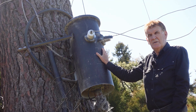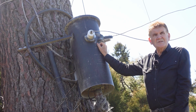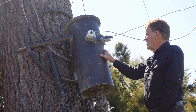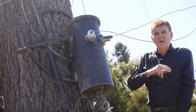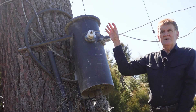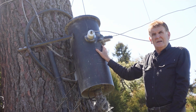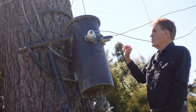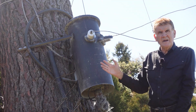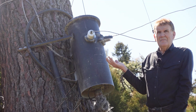That's it — 12 to 1. Now Gary, is it important where you have that balun? Could you have it down at the shack end? Yes, that's the question I often get asked. You place the balun where you change the impedance. I could put the balun down at the house, but then I'd have to run open wire line all the way down to it. For example, if you had a 50 ohm antenna matching and it was three or four hundred meters away from your radio room, you could run it up into a balun like this at one end, run the open wire line with cyclic twist all the way up to the site, and then another balun to take it back to 50 ohms.